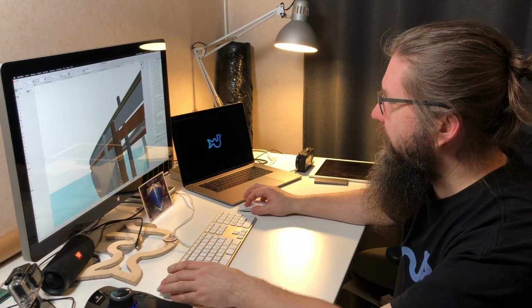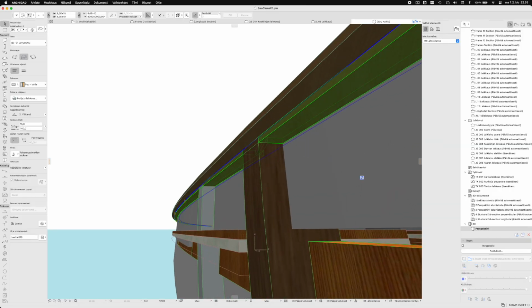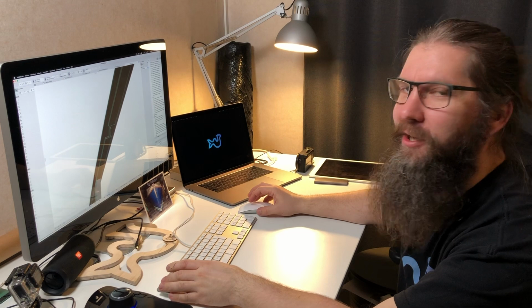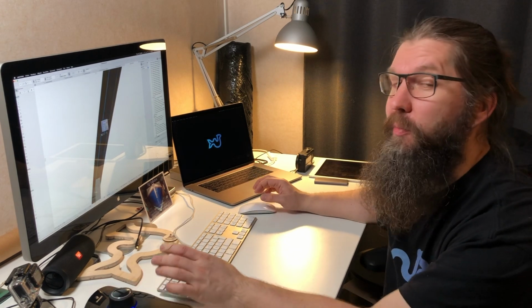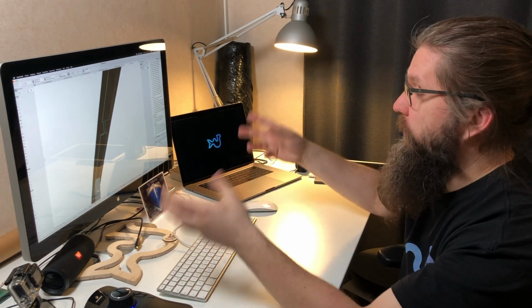So one little detail is that there's actually 2 of these bulwark plywood sheets, and I'm gonna do the upper one. So this is against the floor, and this is on top of that. And I'm gonna do these slots on every frame. So the frame has a slot on the top side, so it should just snap down to these slots if everything goes like it should. So that should keep them in place when filling everything. Of course, these kind of things are possible only if you're doing this thing with CNC. Otherwise, the method would be totally different.